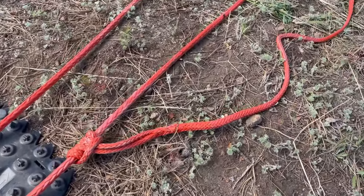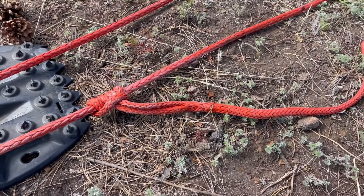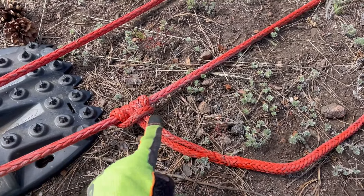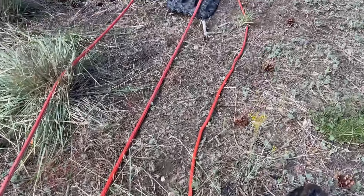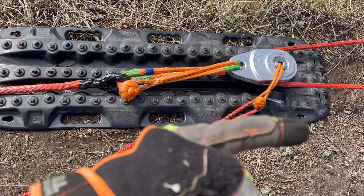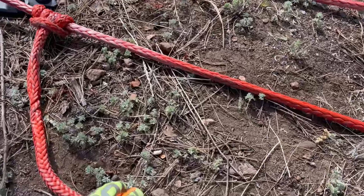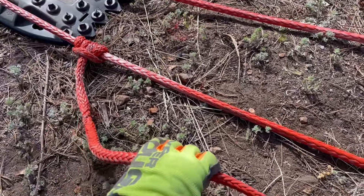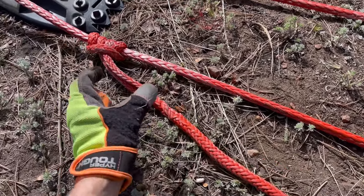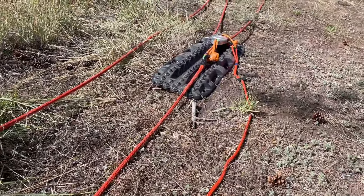The other thing I wanted to mention: I talked about using a Prusik. The idea is that fixing the safety lanyard to another line with a Prusik — if something were to fail in this connection point right here and cause that metal rigging to go that direction — what that Prusik is actually going to do is, as the line starts to tension this way, it's going to lock itself so that it won't skid down under tension along that line, and will help arrest that metal gear.